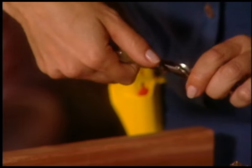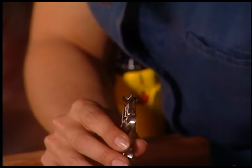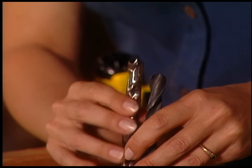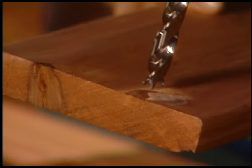So to drill, there are normal drill bits and cool drill bits — that's the kind I want to use. This is a brad point bit. This is a brad point bit, whereas this is a normal bit. This normal bit will skate around on your wood — never a good idea. But the brad point bit is very sharp and it centers the drill so the drill bit won't skate around.